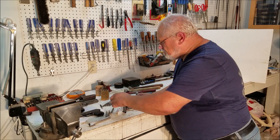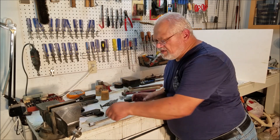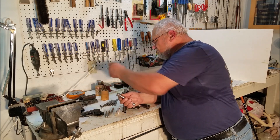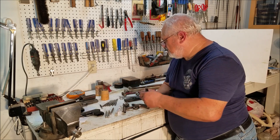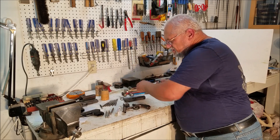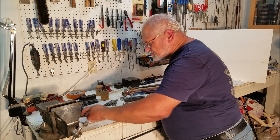Punch sets are important. You'll find you've got trigger pins, hinge pins, all kinds of pins used in guns. The 1911, for example, has a link pin right there. You go and find the punch that fits the size of the pin, and you can drive that pin out. All you need is a small hammer — tap on it lightly, and then increase the power that you tap with as you need to, to get the pin out.